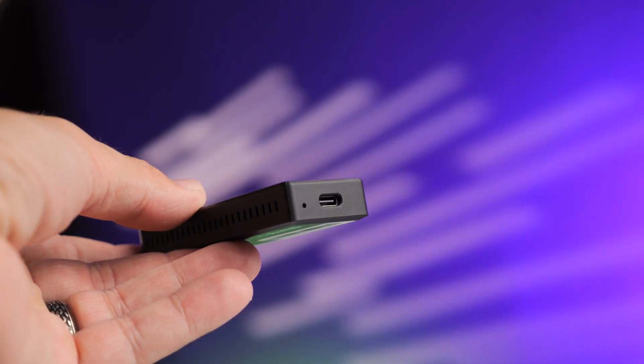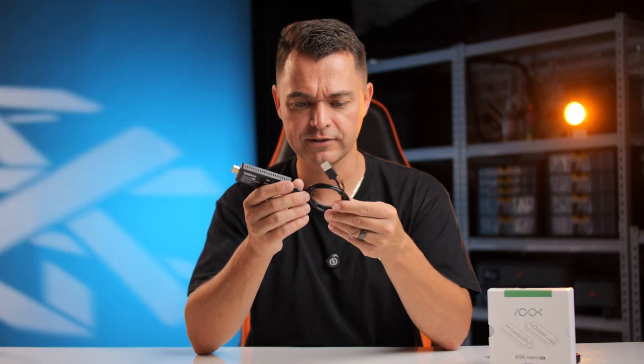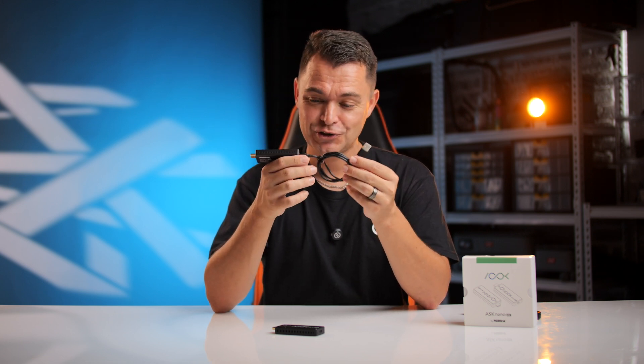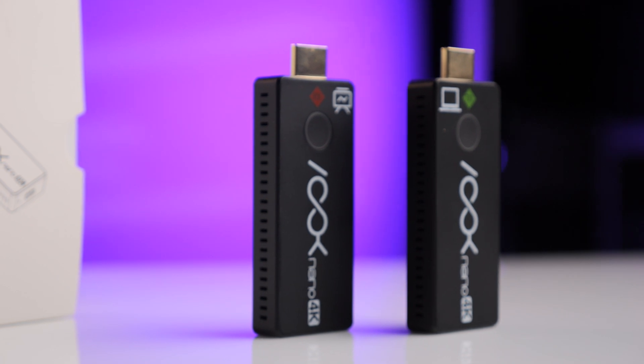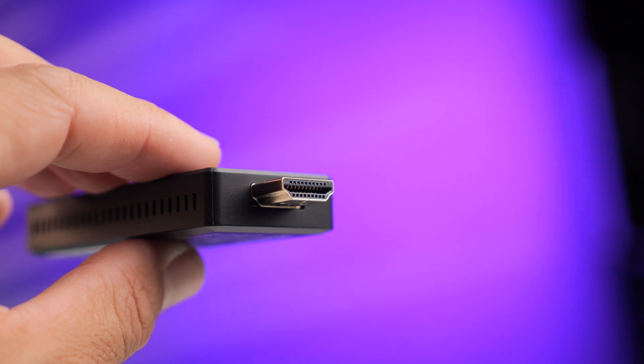One thing to note: if your HDMI port doesn't supply enough power, you need to connect the USB-C cable and plug it into a power bank or any power source. It only requires 5 volts, 1 amp, and uses 2.5 watts. A 5000 milliamp power bank should power it for around 10 hours. Larger transmitters require NPF batteries, so this isn't a major con — adding a battery would have raised the price and increased the size.